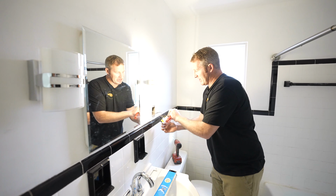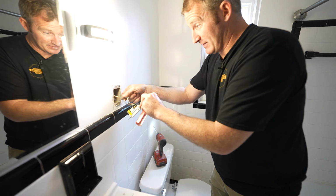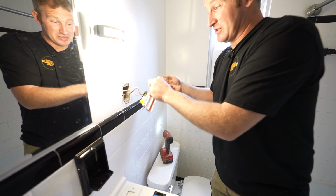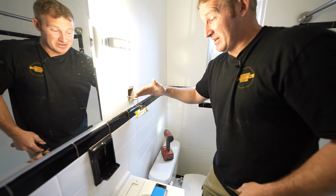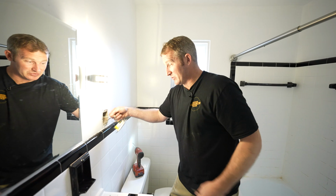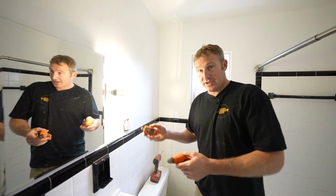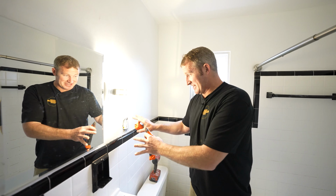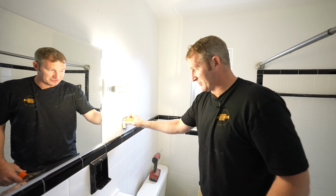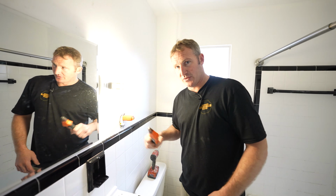So yes, looks like we have some new Romex wires, so that's new. It's the 20 amp gauge wire. So what I'll do is evaluate whether this has its own breaker or not, and I'll use a Klein tool to be able to tell that. Okay, so we established that it has new wiring, so let's go check to see if there's a breaker. So we plug this in, and we'll go see if there's a dedicated breaker to this.